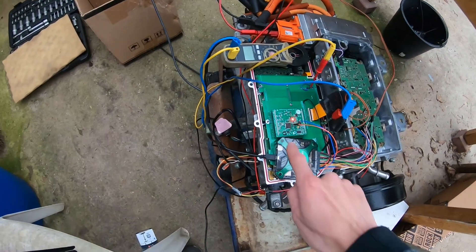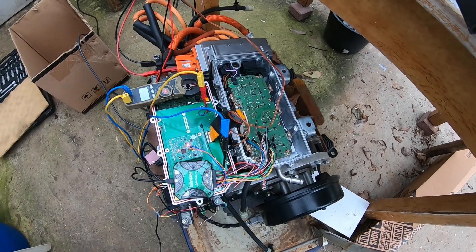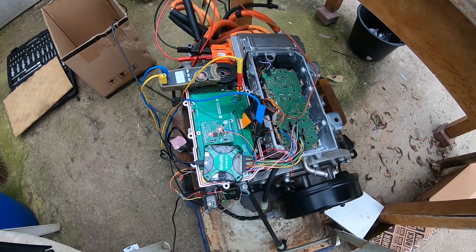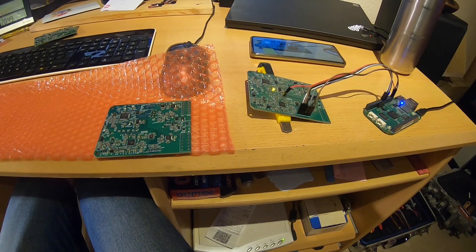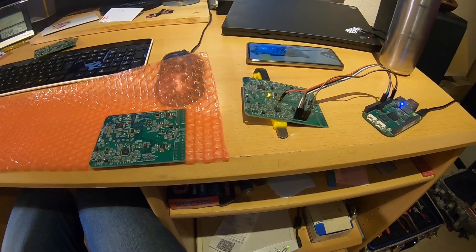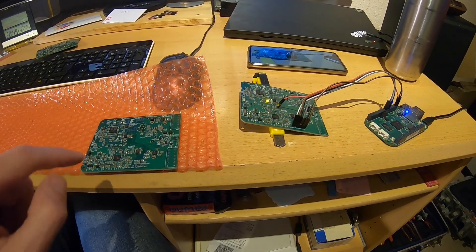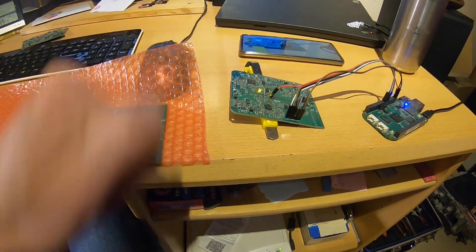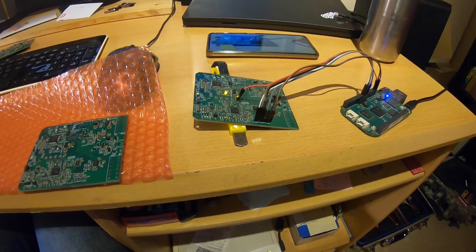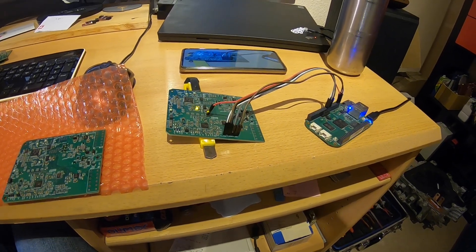One mechanical issue is that this mini mainboard is touching the gate drive board. I will see if it fits with some lower pin header, otherwise I will just design the logic straight onto what's now the adapter board. Now, let's turn to the CCS controllers. These have two programmable parts: one is the small flash add-on, which contains the firmware for the QCA chip, and then obviously the STM32, which contains the actual firmware. We're flashing the small SPI flash by using a BeagleBone and some Linux software called FlashROM, as described in the README.